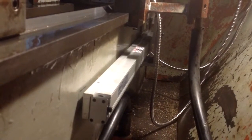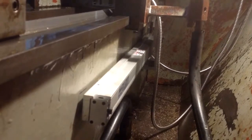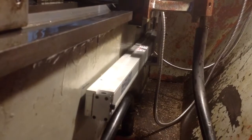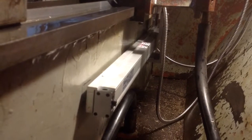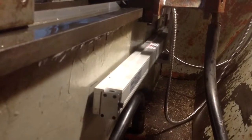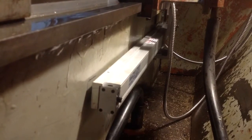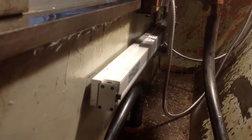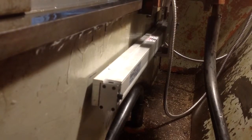It just took time — probably half a day of removing, refitting, leveling, making shims and packers, generally faffing around to get a good result. You've got to do that if you want accuracy and if you don't want to scratch the scales by the read head not moving exactly parallel to the scale. Anyone who's a machinist and is handy with a dial indicator isn't going to have too much problem with that. There are lots of good videos on YouTube, including one by Double Boost where he fits one to a Harrison lathe.